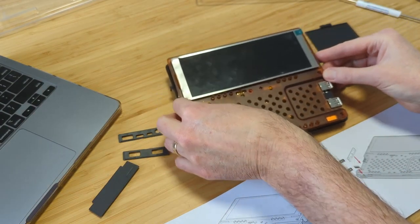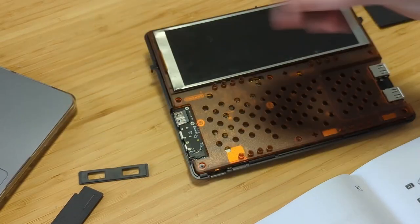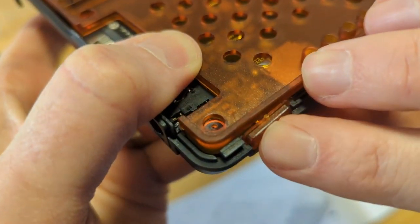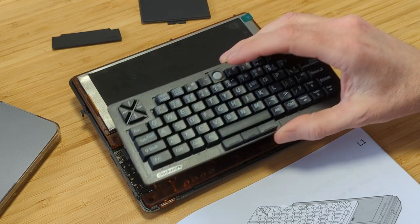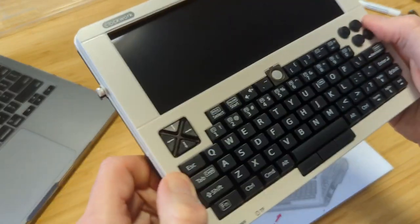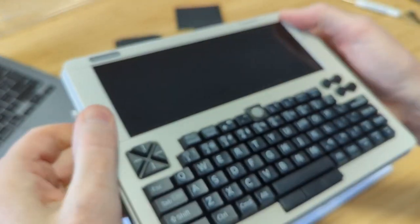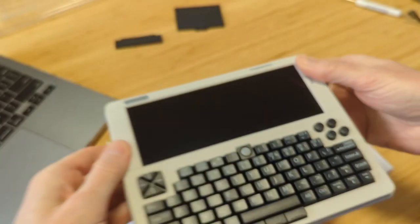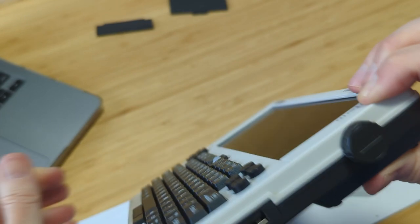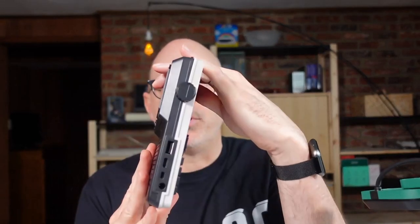Back to assembly — let's mount the back shell. We drop everything assembled so far into the back shell, put the connector panels in as well as the transparent LED button. Now let's mount the keyboard. It uses pogo plugs — simply drop the keyboard on top of the assembly and the pogo plugs make the connection. Now let's mount the front shell. This was very tricky — you've got to align it just right on the clips on the front, push it, and apply a little back pressure to get it on there. Make sure the seam all the way around is tight and connected. It'll take a few tries. Once you do, you assemble your connector wheels, put those on, and screw those on to hold the whole thing together. The whole thing is held together by two simple little wheels — genius.